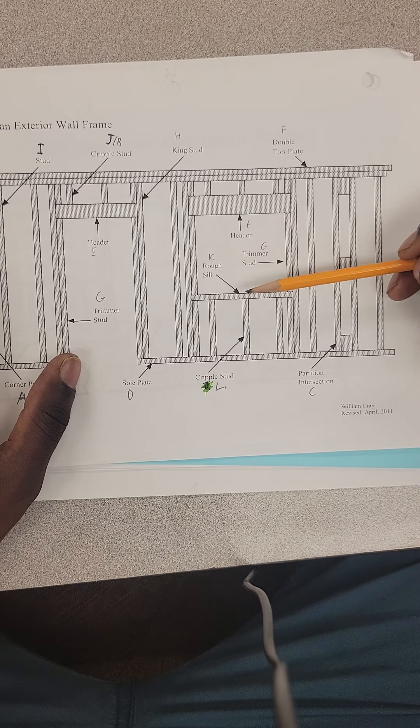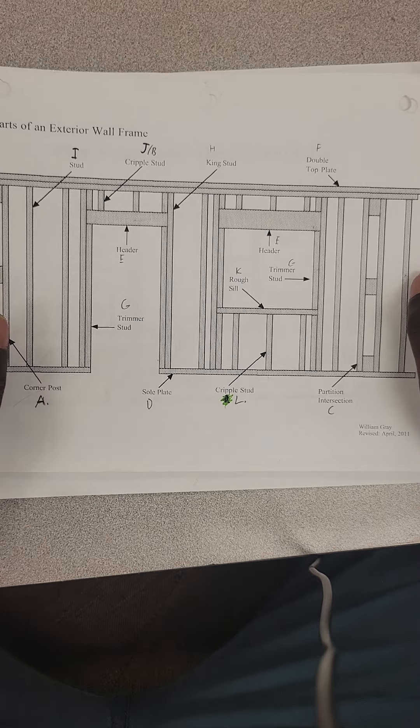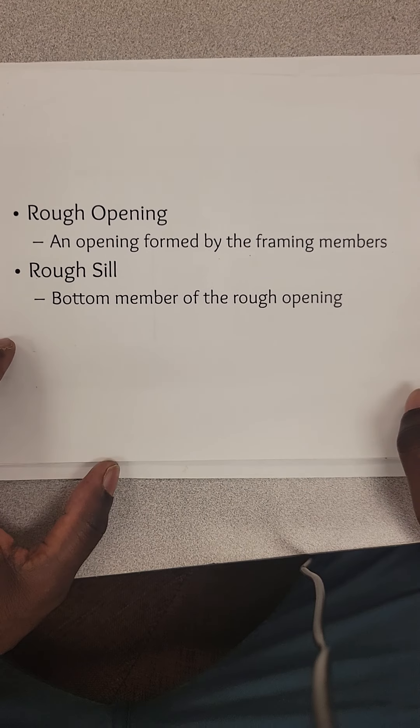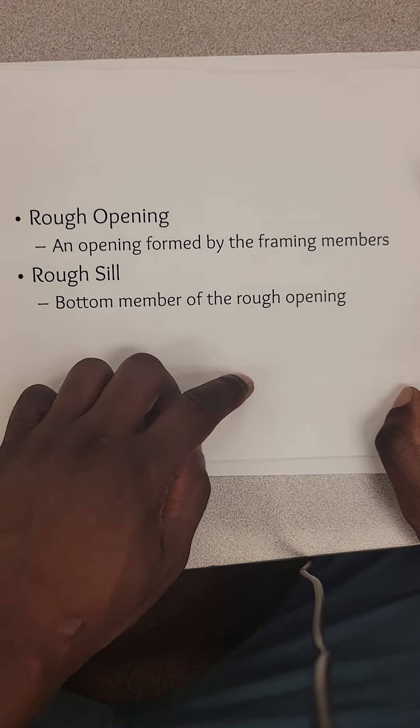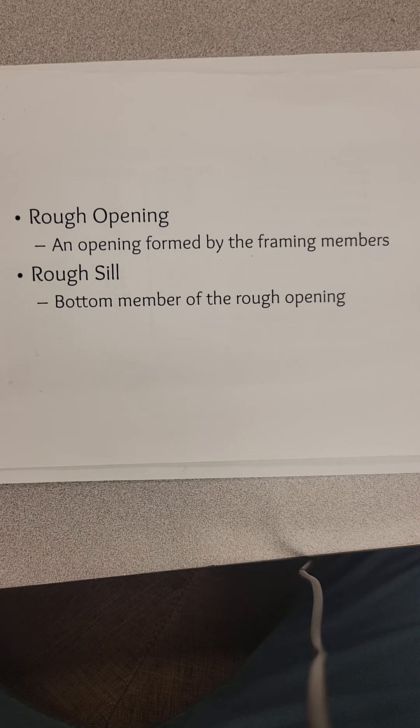So right here is the header and this is the rough opening — you want to leave that room open so you can get the trim in. Get your shims in there; you might have to shim the windows left or right to get the right reveal. If you make it too tight you can't do any of that and then you have to start cutting out wood, which is no good. They give you a rough number so you can accommodate the trim work of any sort.